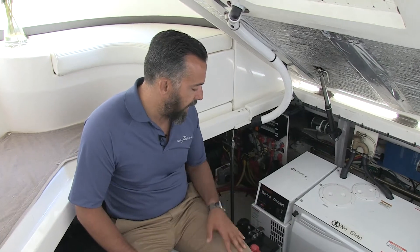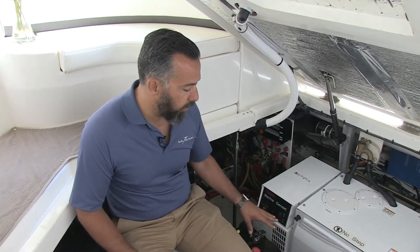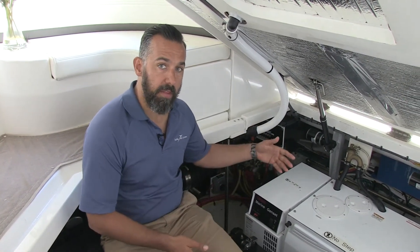We chose AGMs because they're easy to maintain — basically maintenance-free — and they have a nice profile with a lot of space here. We started with the inverter, then did the batteries to give power to run the inverter. The last thing was: how do we know the state of charge of the batteries? So we ended up putting in a battery monitor, sort of like a fuel gauge and speedometer, so the owner knows the depth of discharge, when it's time to recharge, when to stop charging if the batteries are full, and also knows the amps being drawn or charged into the batteries.